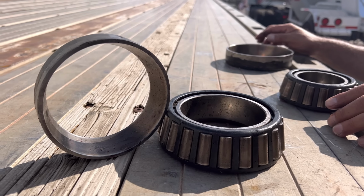And the problem is when you have hard facing down to that point, usually it's pitted all the way around, in chunks. Did something get in there? Well, how? That's awful hard stuff. Whatever. But good thing you guys caught that. I don't understand. I've never seen something like that. Pretty pitted on the inside here too, is it? Yeah. Well, that never moves. When that's in there, that's tight and stationary against the axle, so that doesn't move.